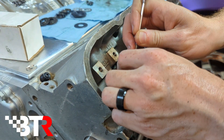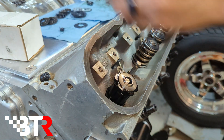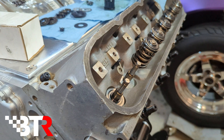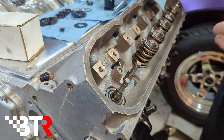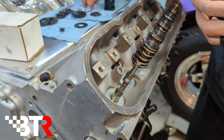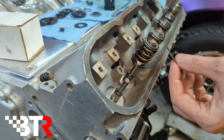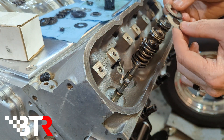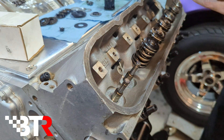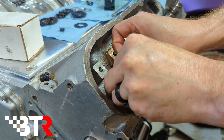So at this point you kind of have to — we're right in between. With 30 thou we're at the bottom; with 15 thou we're up. Now I only have 15s, 30s, and 60s thousands on the shims. So having done this a couple times, sometimes you can kind of move pieces around and use different shims. They may all say they're the exact same, but they're not. So in theory, 2x15 should be the same as that 30, but why don't we try 2x15 shims and see what that gets us.